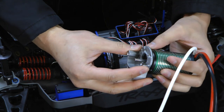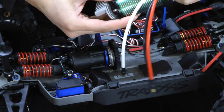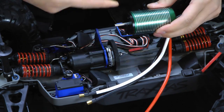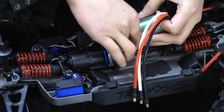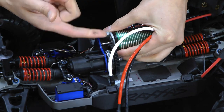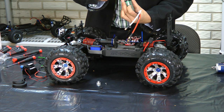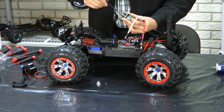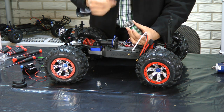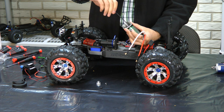When you're going to mount the motor onto this plate, you should probably dry fit it first, because the wires stick out the side and you're going to want them in a particular orientation. You'd hate to put it in with the wires pointing down and find that it doesn't fit. This is why we dry fit. Another tip: put both mounting screws in first loosely, because you don't have much tolerance for play back and forth. If you tighten one down and find the other side doesn't have enough clearance, you're going to have to take it apart. So put them in both loosely, and then come back and tighten them down.